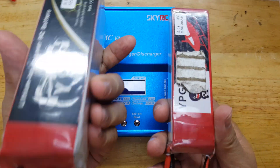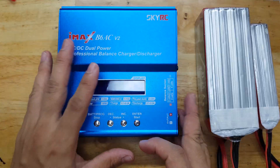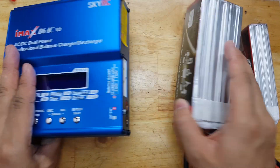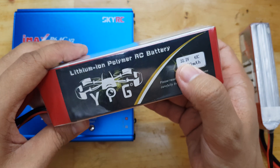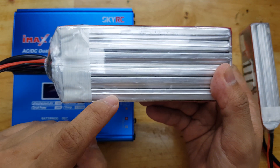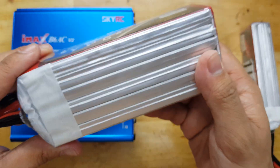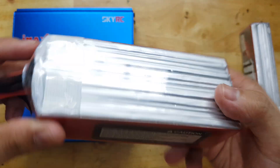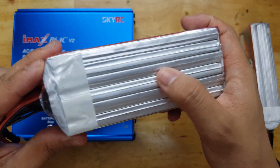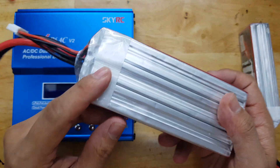These are some of the LiPo batteries that I'm using for my drones. The good thing about this charger is that it has the ability to balance charge your LiPo batteries. This battery is 22.2 volts, which is basically a 6s configuration LiPo — 6 series batteries. These batteries are not simultaneously drained; some are drained faster during operation, so you need to balance charge these types of cells.